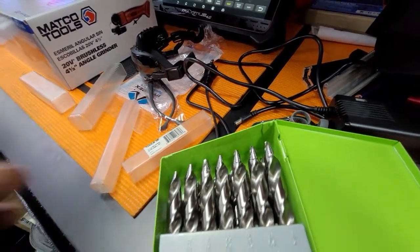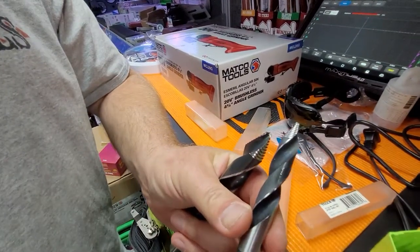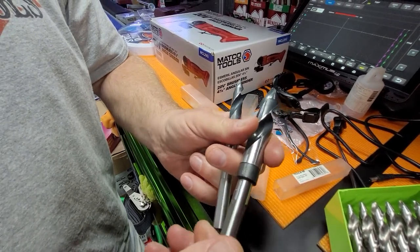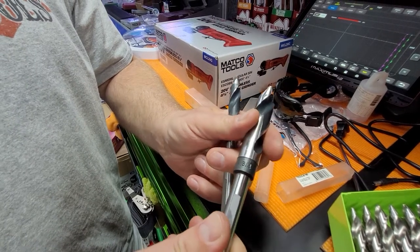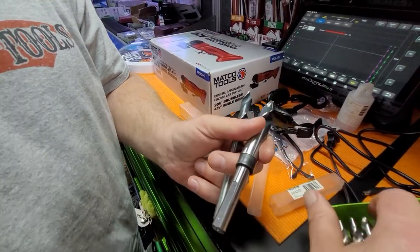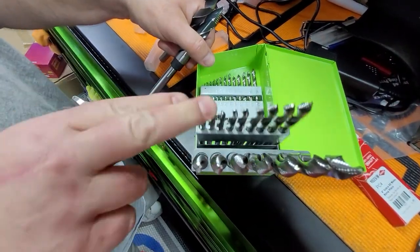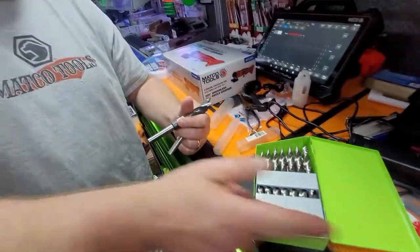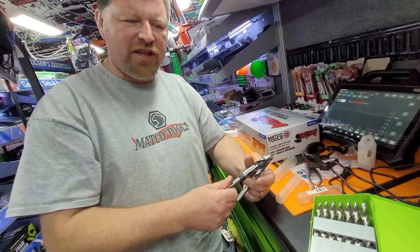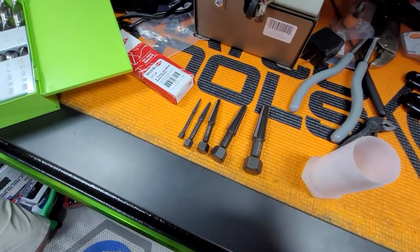I have yet to have them walk when you're drilling — you don't need a pilot hole. This one is 17/32nd and this is a 3/4-inch hole. I'm waiting on one of my bigger drills to come in and then we'll do a demonstration — we're going to drill through a rotor with this. These are lifetime warranty. Most times when you're drilling something out to use the extractors, you'd start with an eighth-inch hole and work your way up, but you don't have to do that with these Hyper Bits — they just go.